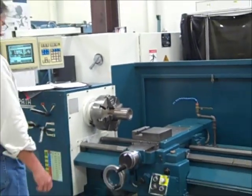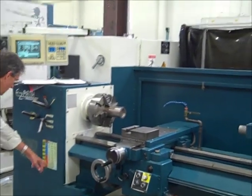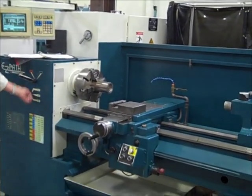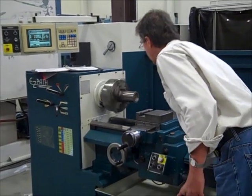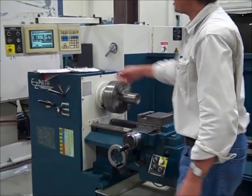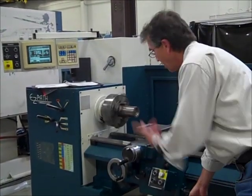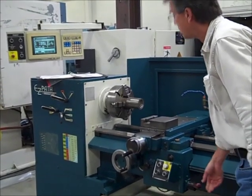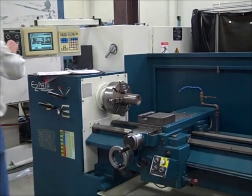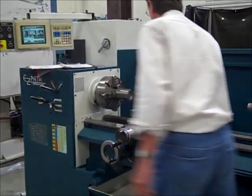At this point, I could probably bring up some spindle speeds. We'll do a couple of low ones. Green, red, two, three. Two, get this one, see what we get. It's low speed, of course, and the spindle is high, actually, that's high, I didn't realize it. Watch the brake coming, here's neutral, brake. We stay in the same range but flip over to low, which should give us around 45 RPM, maybe.